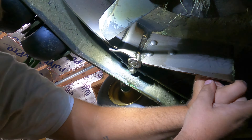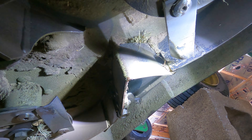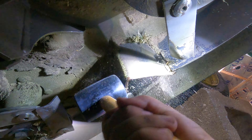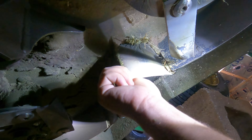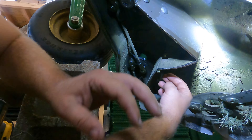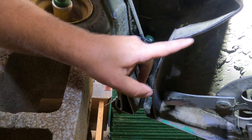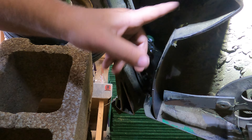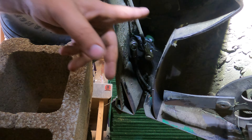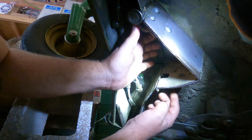This is not in a bind really, because it will wiggle. Let's see if the other end's in a bind. This is not completely in a bind — it's got some wiggle to it. What I just realized is that right now it's in the closed position. This is supposed to swing backward. It looks to me like this curve right here should be on the other side of this plate so that when you open it, it swings back this way. Somehow this has jumped over there. I think when I had the mower lifted, I got this popped on the wrong side of this plate. If I take these three nuts loose, I can get it back where it goes.